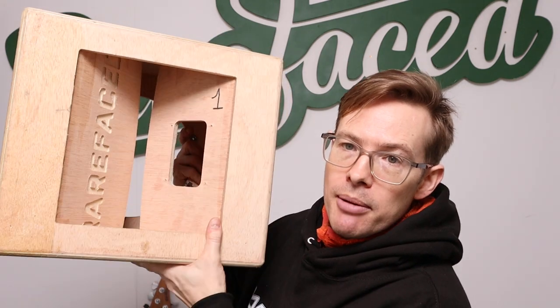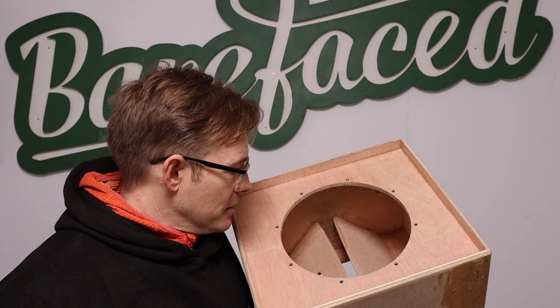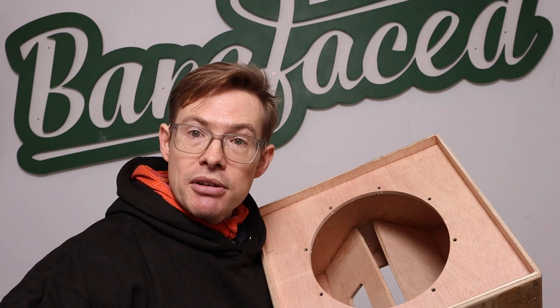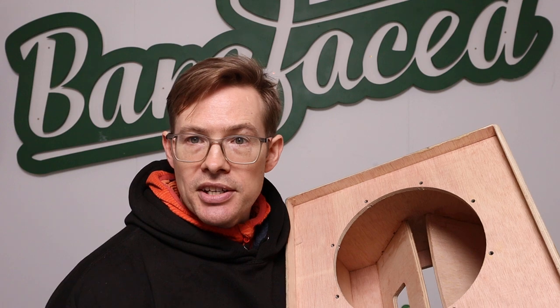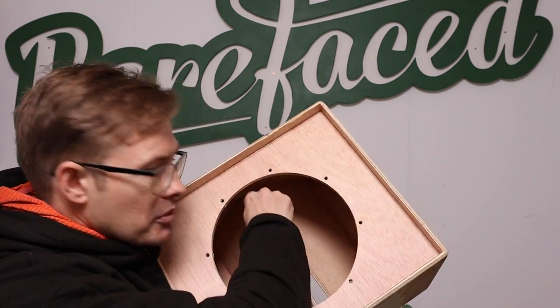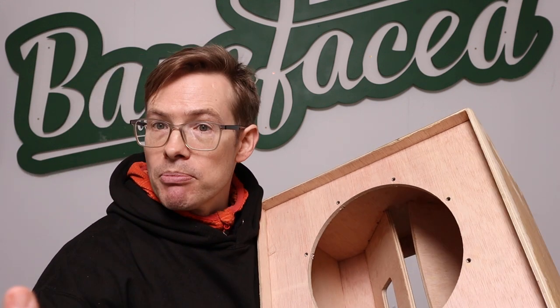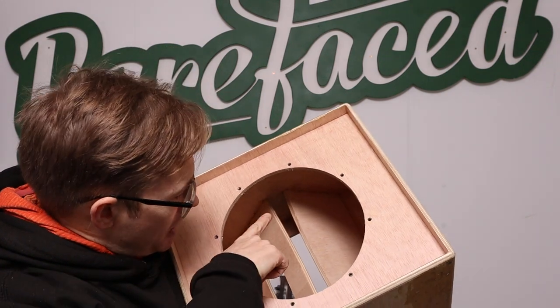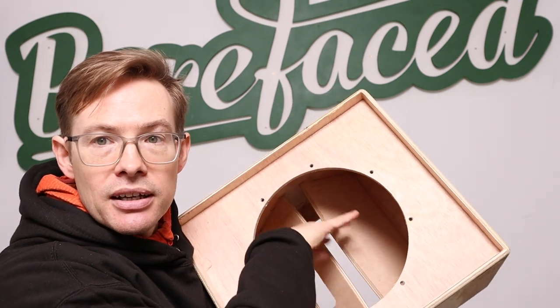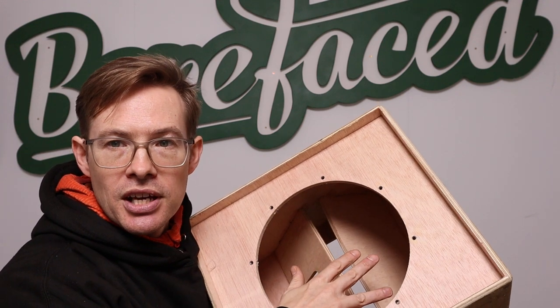You've got an air mass inside the port — just like the air mass in the sound hole of your guitar that resonates. Obviously, increasing mass decreases resonant frequency — quite intuitive, that something heavier, like a heavier string, will resonate more slowly with a given spring rate affecting it. So that's like your string tension. The stiffness of the air spring — the stiffness or the compliance, which is the inverse of stiffness — is essentially this area here. The bigger that area, the more of the internal air is pushing on it, so the greater the stiffness.